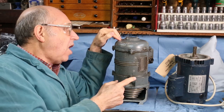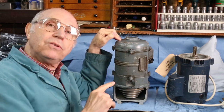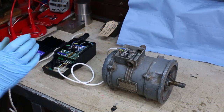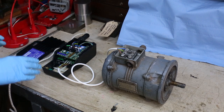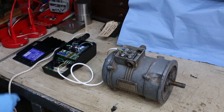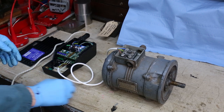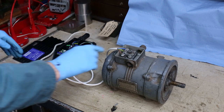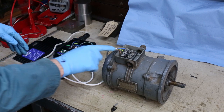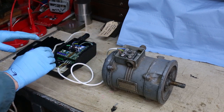Let's go back a week in the past and see me rebuilding this motor. It's going to start with me about to switch it on to see if it works. Now this was used last in a proper factory that had 415 volts three-phase — we're in the UK here. The box I've got it connected to is an inverter that runs from the mains and produces three-phase at 230 volts. The motor was configured in star for running on 415 volts. We're going to be running on 230, so we need to change the configuration to delta, and I've taken care of that.